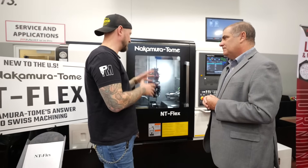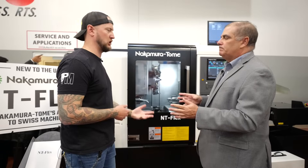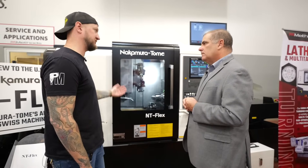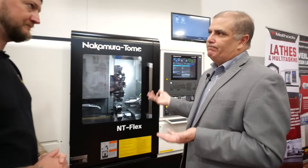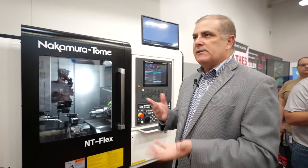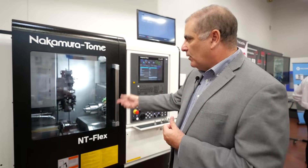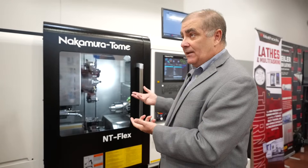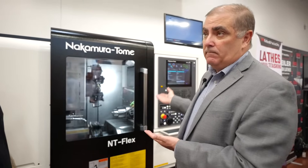The flexibility is really interesting here. When talking about a Swiss machine, typically you're not going to run 20 parts — maybe not even 100 parts. On this machine you can do those 10,000-part runs, but if you need to throw five parts in here, you can also do that. So again, you can do high mix, low volume, and also high volume applications — where with a Swiss you really don't want to be changing over every day; you want to run it for at least a week before changing over. On a machine like this, you can changeover easily. There's also a large selection of tools you can leave resident on the machine — with half-index holders pointing both directions. So if you are changing over, it's just a matter of calling a different program.